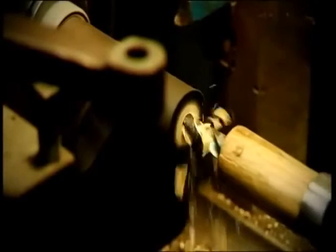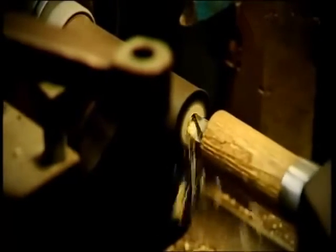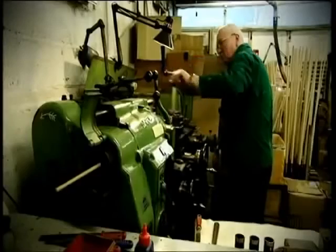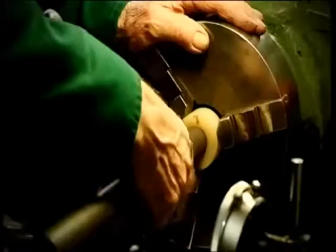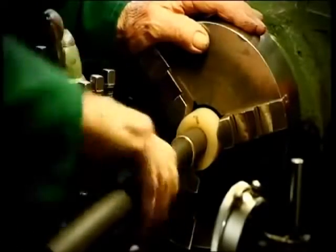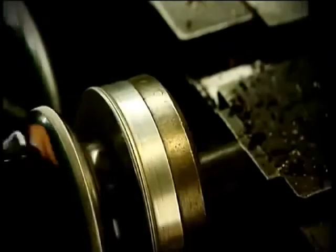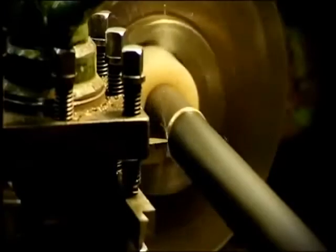Some of the cues are one piece, but the majority nowadays do have joints in them. We take a lot of trouble over fitting these joints. I think if you're going to cut a cue in half, it's very important that it feels as good and as solid as before it was cut. So we take a lot of time and trouble in precision fitting the brass joints that we use, and then the faces are faced off precisely so that the cue is dead straight once that's happened.